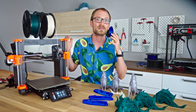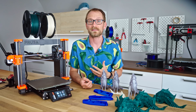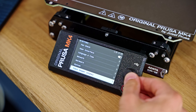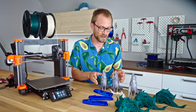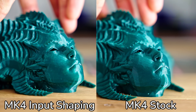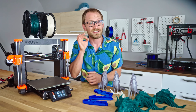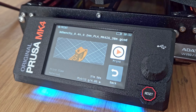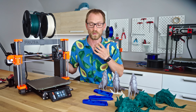But the Mark IV doesn't have any way to measure the dynamics of its axes. The mainboard does have a connector for an accelerometer, but it doesn't ship with one, and as far as I can tell, the firmware currently doesn't support it. Instead, Prusa trusts their consistency with assembled printers so much that they ship one universal pre-made tuning for all printers. And on mine, that tune makes prints turn out arguably worse than without input shaping. Which is odd, because one of the main points about input shaping on the Mark IV was that it wasn't going to boost print speeds into the realms of a CoreXY machine, but instead focus on improving quality while providing just a little bit of a speed boost. This is still a pre-release alpha preview, so it's not finished yet, but this is a printer that is shipping and that you can buy right now, so I can only assess what's already available.